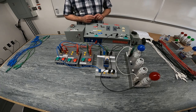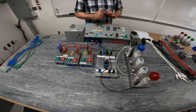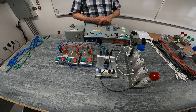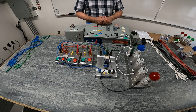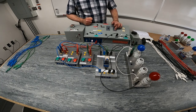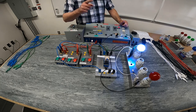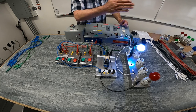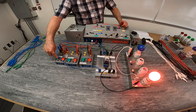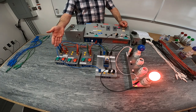Let's activate our circuitry and see what happens. When I turn on my 120-volt power supply, will one of my lights be energized and the other de-energized, or both energized, or both de-energized? I'm going to turn on my 24 volt — we're on — then turn on my 120. Our blue light is on right now. So now I want to activate my red light, energize my red, de-energize my blue, and let's hit my switch. When I let go, it stays activated because of my holding contacts.